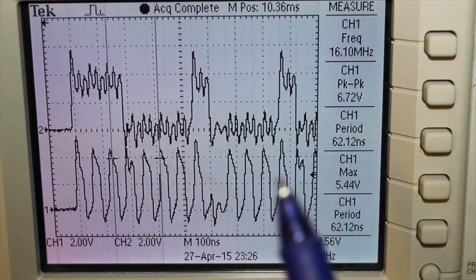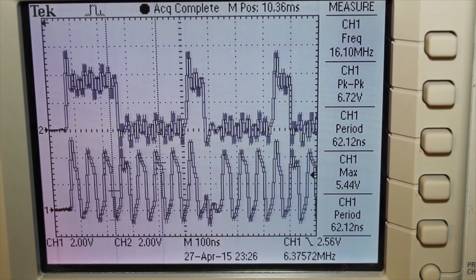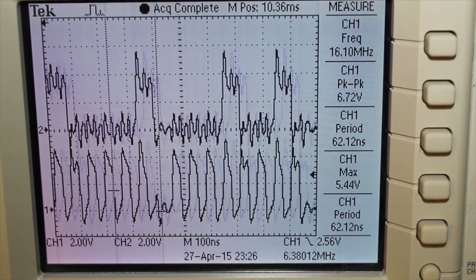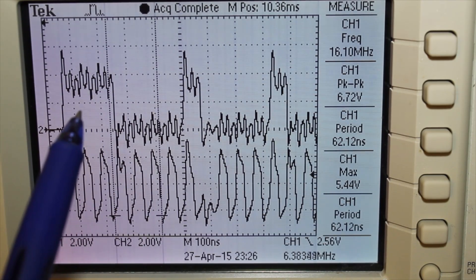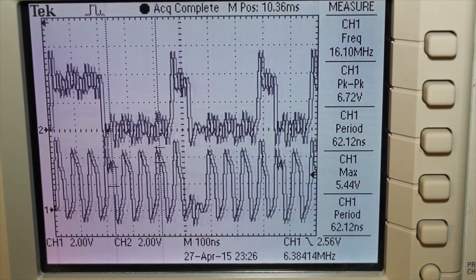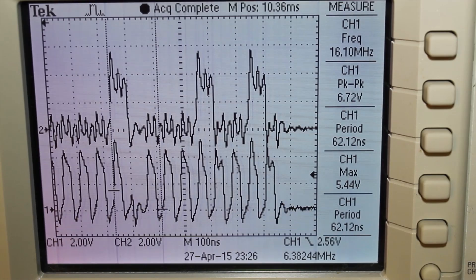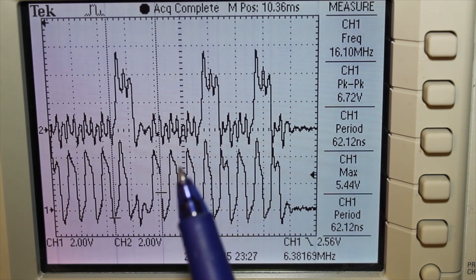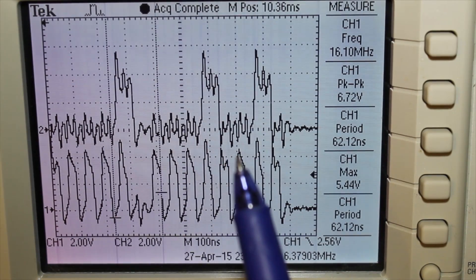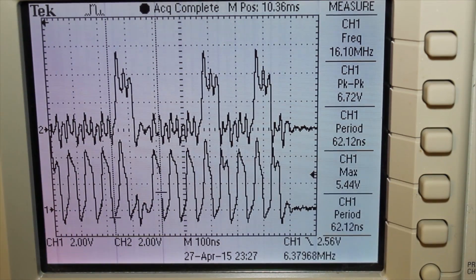After a slight pause we get the other eight bits of our word. We have those three bits that say this is a DAC command for pin 6, and then the actual binary message follows. We can read out: 1, 0, 0, 0, 1, 0, 0, 1, 0 — that's the binary message that went out to the DAC. This is the SPI signal as captured on the scope.